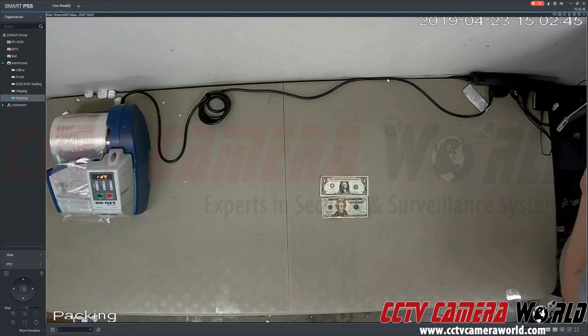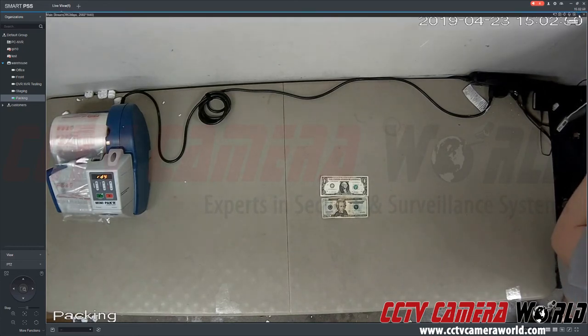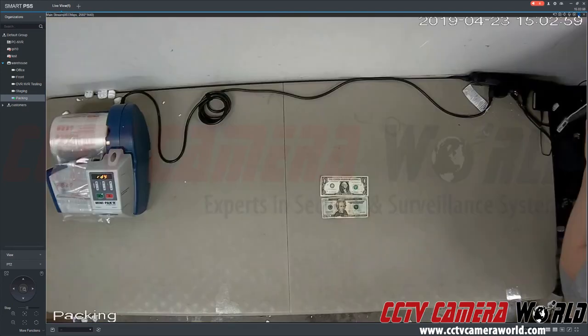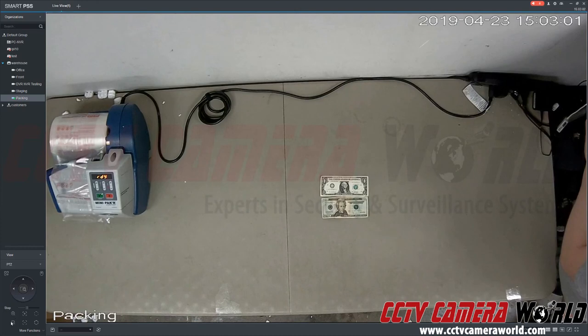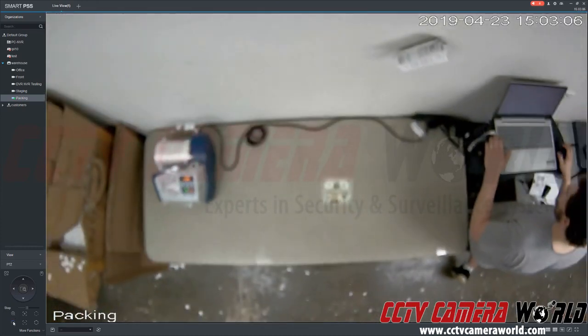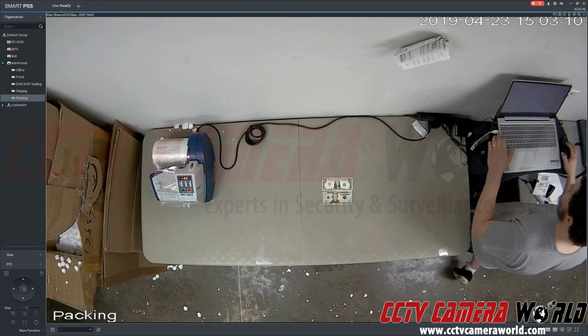So what I'm doing is decreasing my viewing area and zooming in further to get more detail on live and recorded video. On recorded video I can magnify it and see better using digital zoom. To summarize: this is digital zoom and this is motorized zoom — motorized zoom works only on live video, not on recorded video. Thanks for watching.